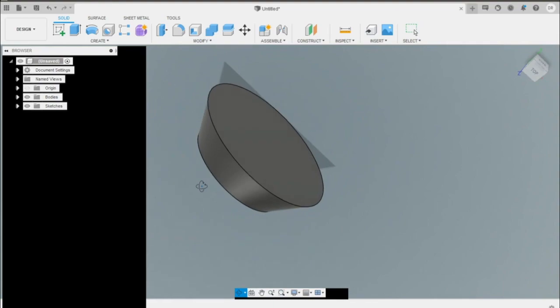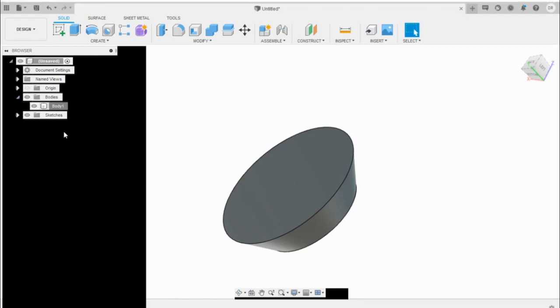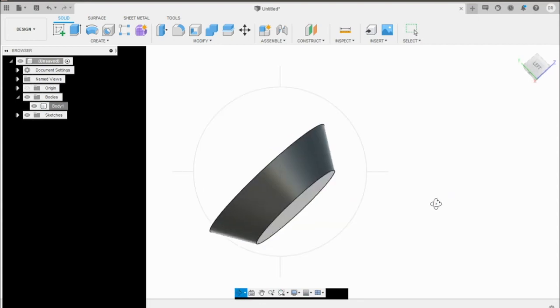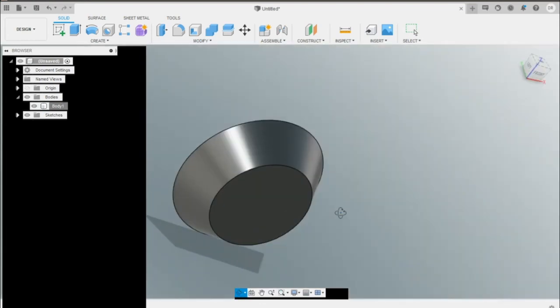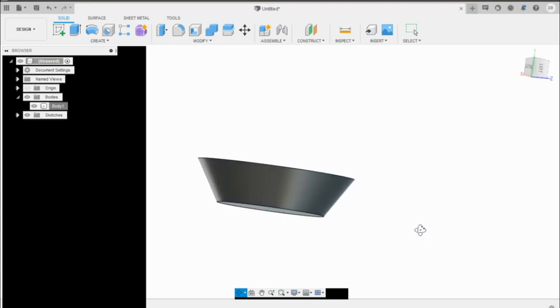You can save it right now — go to Bodies, save as STL, and print it in TPU. I've done this and it works if you are a foot or more from the heat source. TPU prints at a pretty high temperature so you can do quite a bit with the printable one. But I'll show you the next step: creating an injection silicone mold version, which will be more flexible and better conform to pipes with small diameter variations.